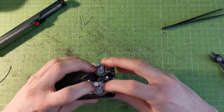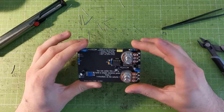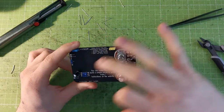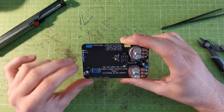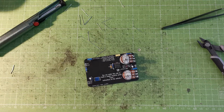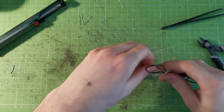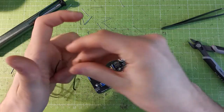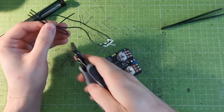Once placed and soldered, you can also solder from the other side if you prefer — it's exactly the same. Now for the last part we need to put some wires on the board. You have a DC barrel jack connection for plus and minus power supply (9V), input and ground for the input jack, and output and ground for the output jack. I strongly suggest color-coding your wires — cut three lengths of about four or five centimeters — so you can see which one is ground right away.